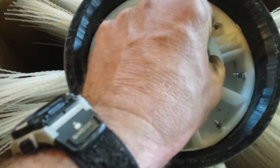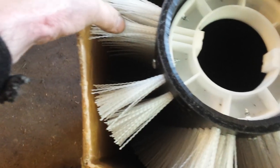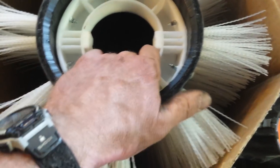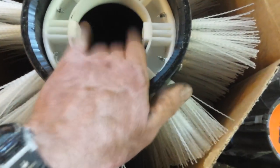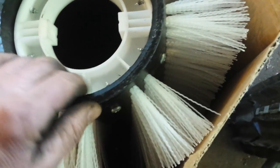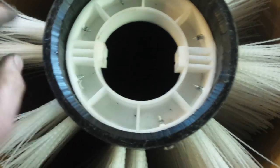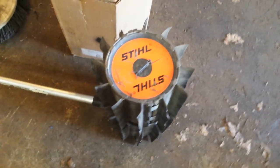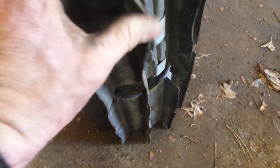The main broom fits — it's made to fit. The drive mechanism has two grooves to fit in here, and as it wears down, right now we're about halfway. I'll keep this spare with me when I'm sweeping, and if it gets to the point where it's not working anymore we just pull the old broom off and put this one on. It's basically a big piece of PVC pipe with a piece on the end and all the bristles — there are holes drilled in it and they're glued in there. When storing one of these, keep it upright like that — don't ever store it on its side, because over time the blades will bend right over and then it won't work.